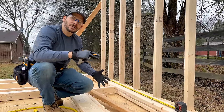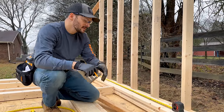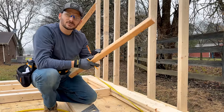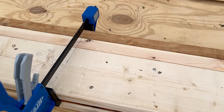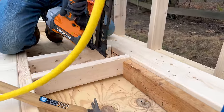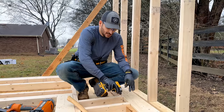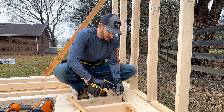For the center window, instead of measuring in from left and right, I'm going to find my center point. I already marked the bottom, and I know the top is at 77. I mark the center, use my spacer, clamp it in place — that ensures the window is perfectly centered. I'm nailing these from the outside since the inside is where the window will be. It's hard to get into the tight spots, so I'm using some screws to make sure everything is nice and secure.